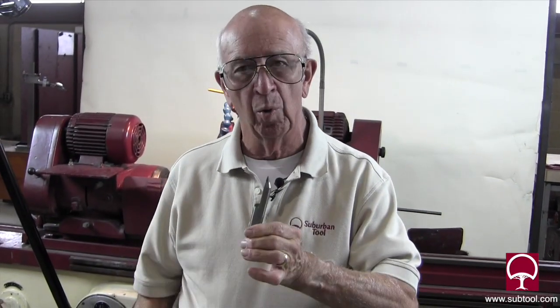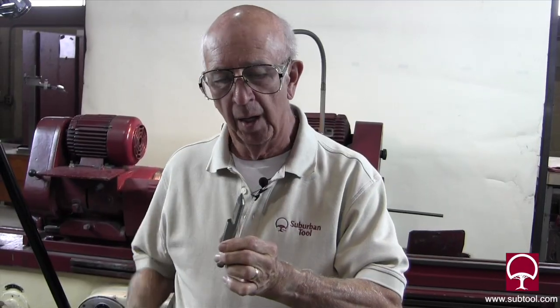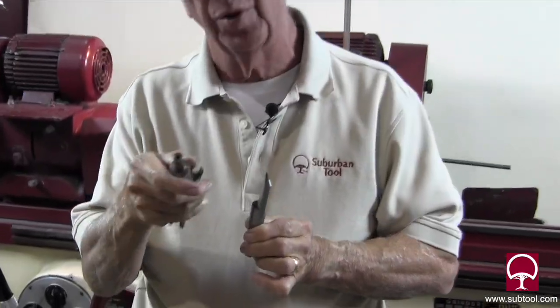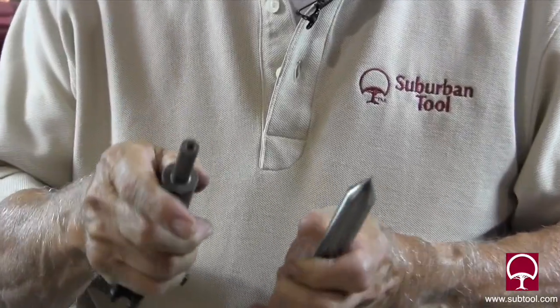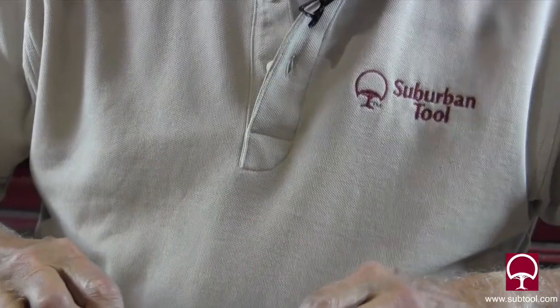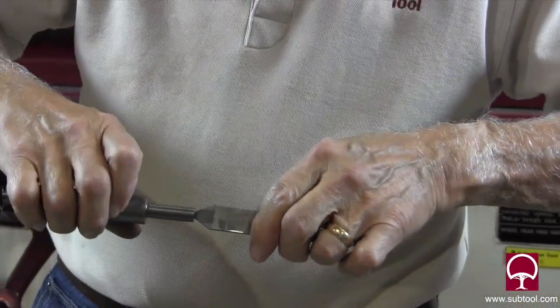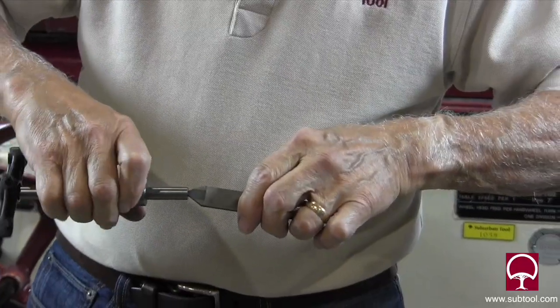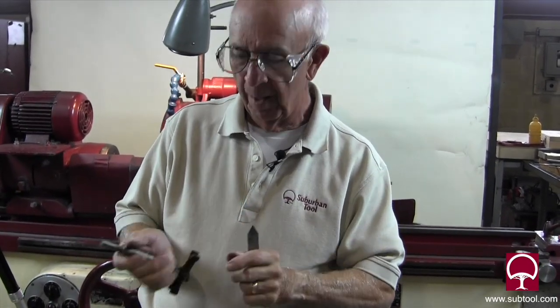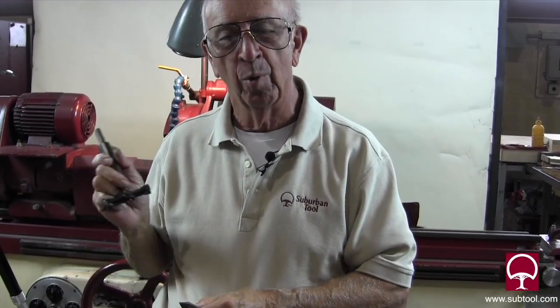This is the center we're going to use on the tail stock. It has a clearance for the wheel but it's got this flat, which could cause a problem. If the center is not lapped and there's a burr in there, every time you go around the flat spot it's going to clunk, and that's going to cause your part to be out of round. So make sure the centers are lapped and put a little bit of lubricant in it. We're going to put it on the OD grinder and show you how it works.